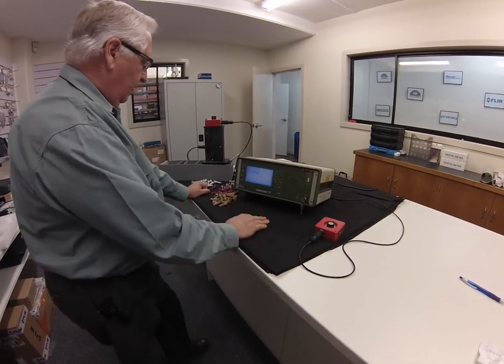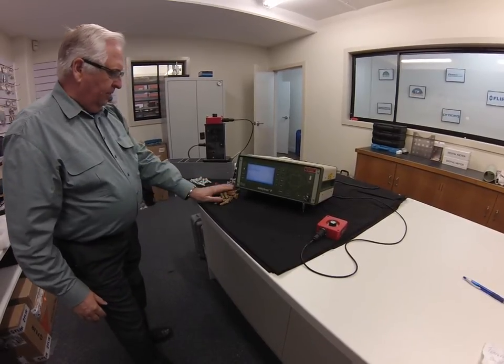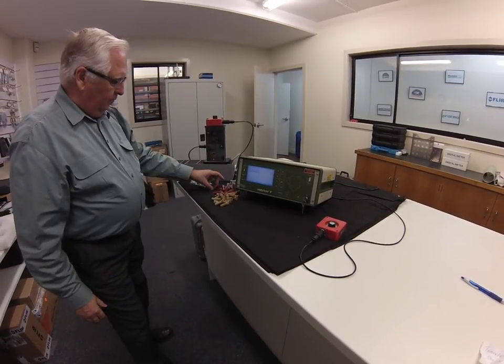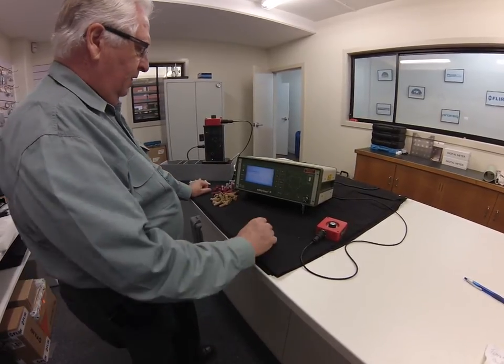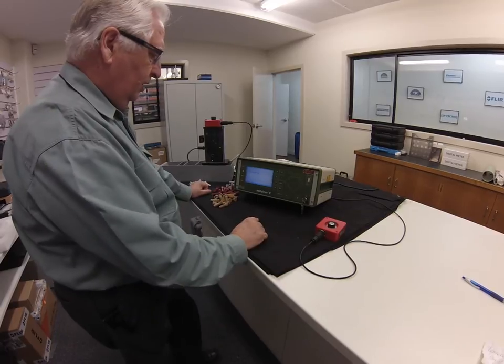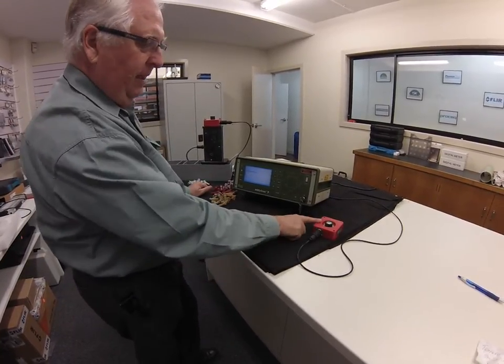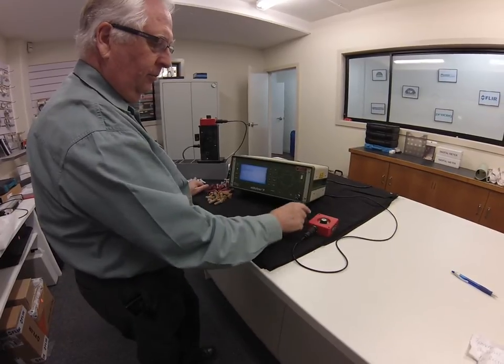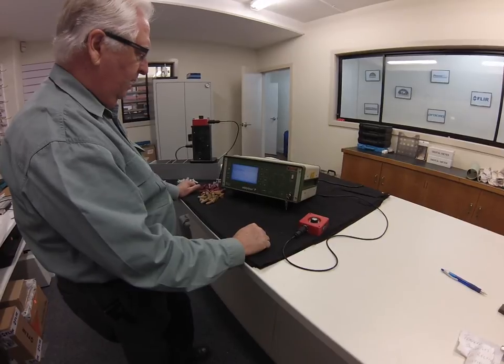The unit's on and we're going. We've got a group of bolts here. The silver ones are good ones, the orange ones and the red ones and the grey ones are defective. We teach the machine how to do the inspection by feeding it good parts. In here we've got a balance coil. It's not a reference coil, but just a balance to keep the coil loaded with some current.